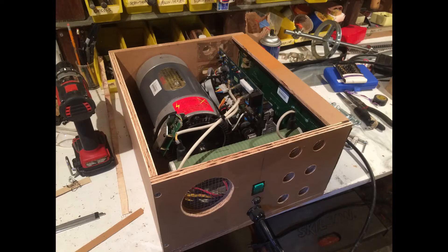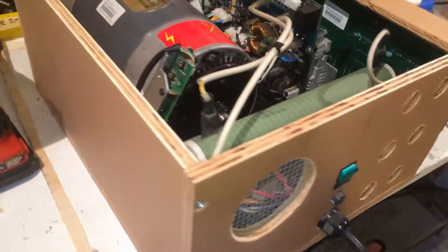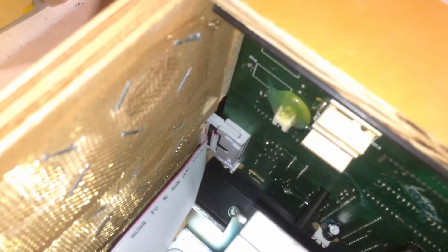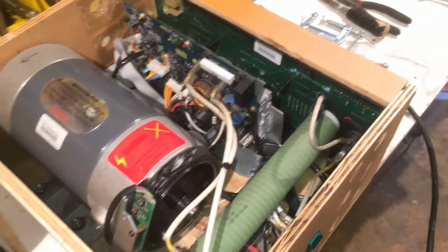This is the motor box I built to house the motor. You can see there's a lot of stuff to pack in with the controller and all the associated electronics, the interface board and everything — a lot of tight fits. I wanted to keep this box pretty structurally sound so that it could handle buckets of apples on top of it, and of course there are some vents for airflow through the case. I had to hack some things — there's an incline motor that treadmills often have and the computer would get confused when it wasn't connected, so I had to wire up some resistors to present the right voltages to the control board so that it would be happy.